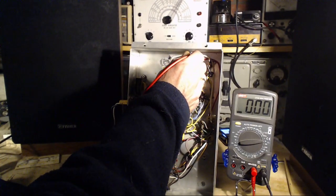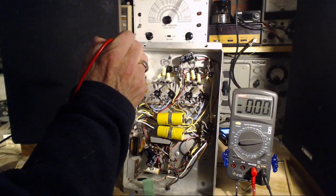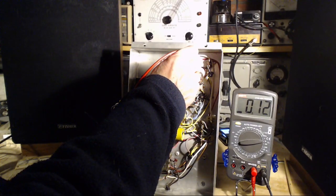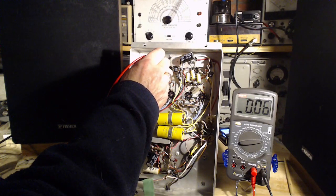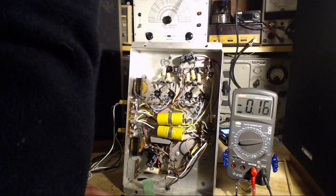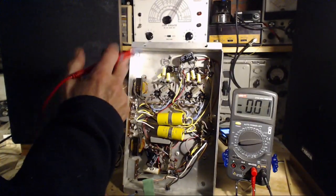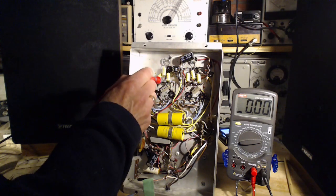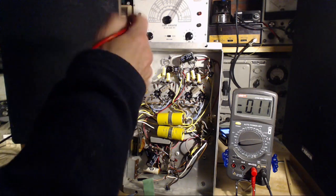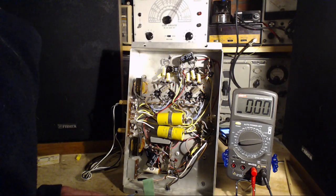About a zero there. Not a zero there. Slight positive. So I don't know what these meter readings really mean. That's the grid. I still have those gigantic 7 megohm resistors in there, acting like antennas, maybe. So I've capacitored it right to the ground through this capacitor. I should put the smaller resistors in and see if that finishes off the hum.